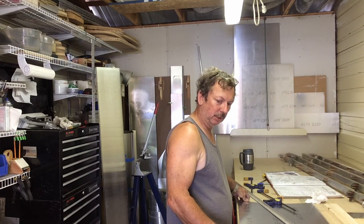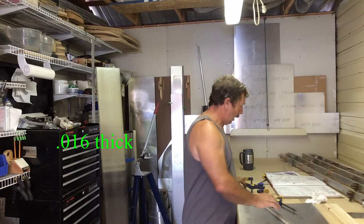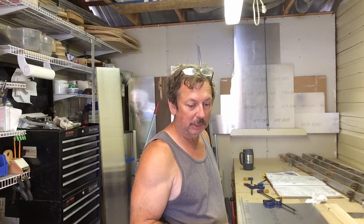It takes one sheet of aluminum for the 701, 60 thousandths thick. We have a 15 millimeter flange bent up at 15 degrees, as I believe the dimensions are on the plans — that goes on the trailing edge, the bottom of the skin on the trailing edge.